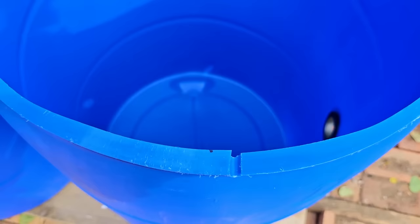You might be able to tell we've got a bit of a problem here - that is the amount of space I have to put one of these cuffs. Never fear though, I am the king of scrounging and saving. I've loads of pipe left over so it's easy enough to swap over this top section just by undoing the valve itself, taking off this fitting, popping on this one here, adding an O-ring to help make the seal watertight, and popping on the valve again. We're not going to get the valve handle all the way to the front, but I'm fine with that - it'll open off to the side so it won't be in the walkway. I'll mark this pipe here for cutting and take it off.